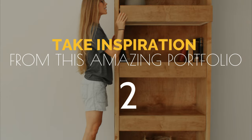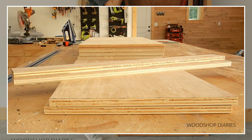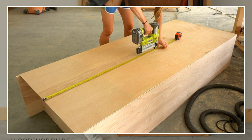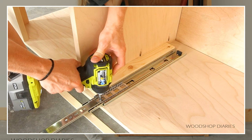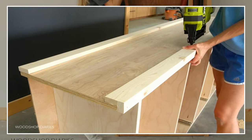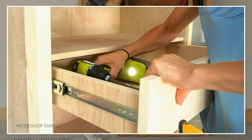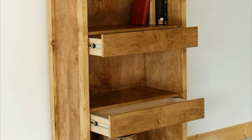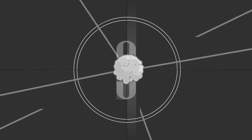Number 2: take inspiration from this amazing portfolio. Cut down the plywood sheets to get started using a Kreg Rip-Cut or circular saw. Add a back panel with another sheet of plywood to fit over the body. Install the drawer slides to the shelves' front edge. Next, install trim on the bookshelf sides before building and installing the hidden storage. Add the drawer fronts by cutting a plywood sheet into four, then install the crown and the top panel, and apply finish after ensuring a smooth surface.